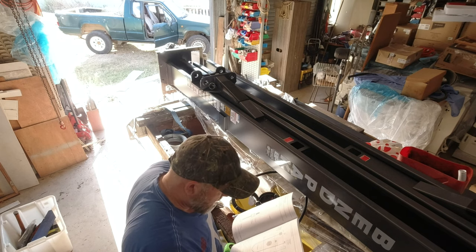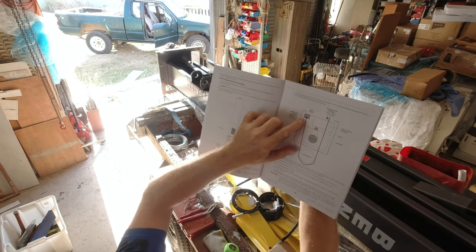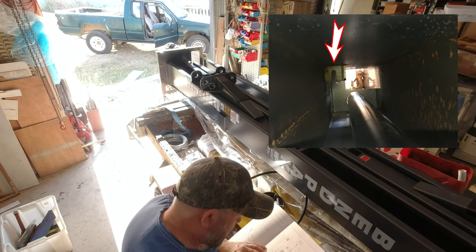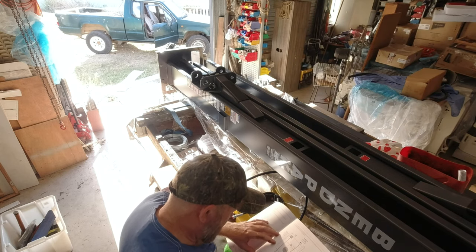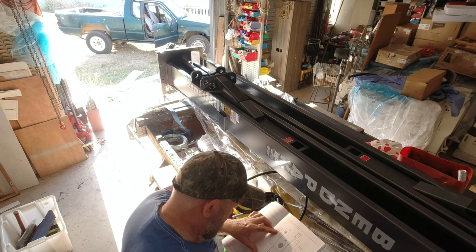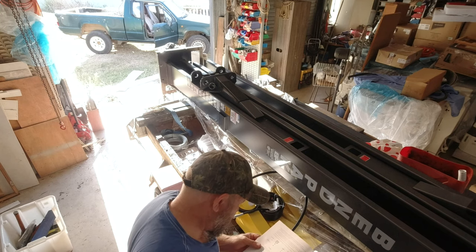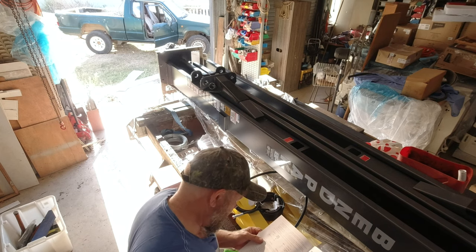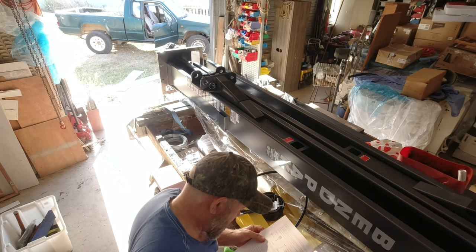It looks something like the following. Yeah, okay. Well, so you hook it in, that bit that I showed you on the camera. This is saying looking from the bottom, which is what that shot is. Bottom is on the other side of the lock plate. So, okay, push the button end up through the bottom of the lift head towards the lock plate. Put the button end of the equalizing cable into the slot in the lock plate.